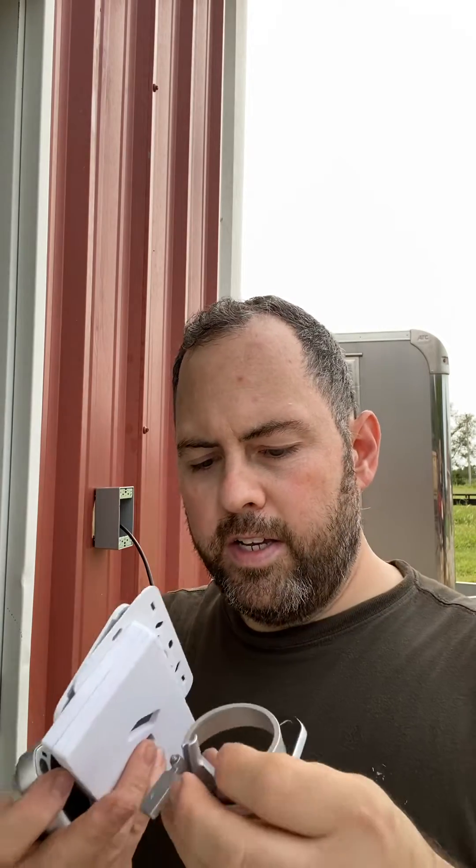This comes with a few mounting options. You can mount it into two-inch holes — you just take a two-inch hole saw, knock a hole in the wall you're going to be mounting it in, and use this little bezel right here. It's got a little piece of plastic and a screw, so when you stick it in there you swivel this thing around and that screw is going to pull it tight to the back of the hole, just like a remodeled electrical box. We're not going to be using that today so we're not going to need that piece.